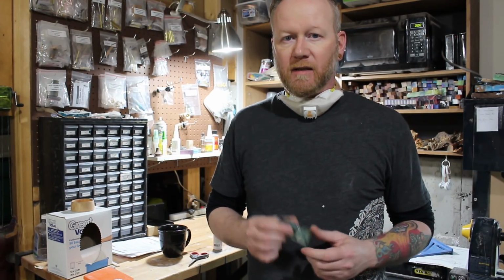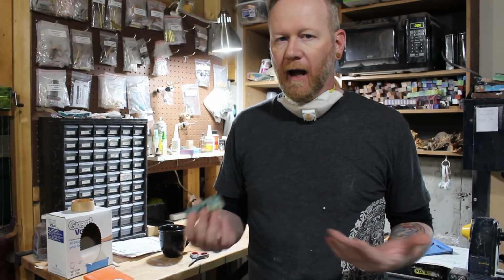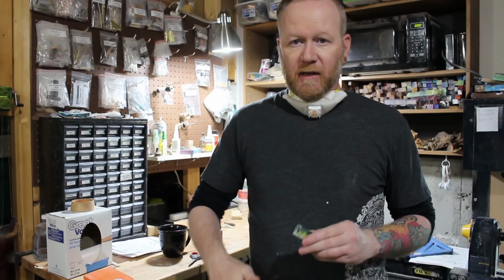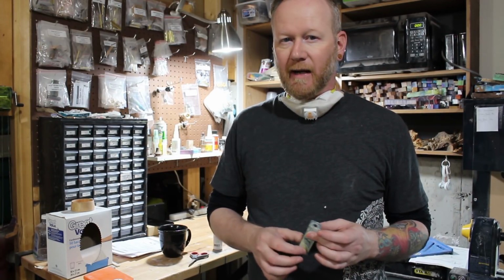I've used a pen mill since I started making pens, and I've never seemed to have any problems with it. They work fine, end up with a nice level cut on them, but I also keep mine sharp. Usually after every second or third pen, I take that little mill body piece, that little thick round piece you saw me putting on, and I sharpen it with 600 and a 1000 diamond card.